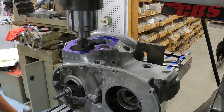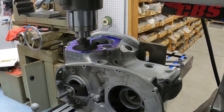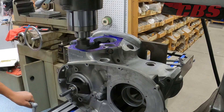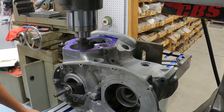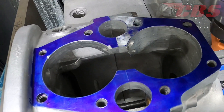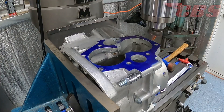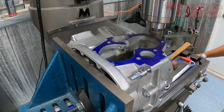Look closely on the side and see our machine shop inspector — Puppet Dog Milo gave me a few tips so we can execute this job. What you see here is a high spot, which I was expecting because I've run the indicator on all areas. So everything's looking good. We will raise the Z-axis about one thousandth — one thousandth each pass — and we will keep going and see what we get.